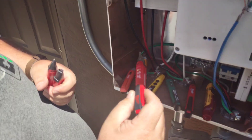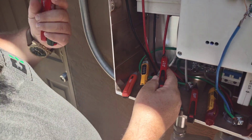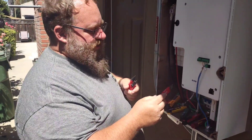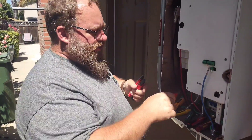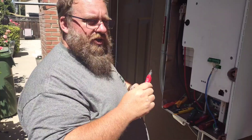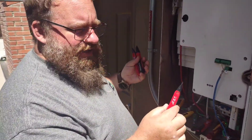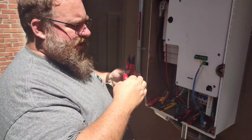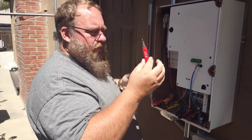The only problem I have with their newest version — these are a little more expensive — is the sound is kind of dull and a little slower, and it's going to take me a minute to get used to. Now why would that be important? Let's say we have a loose connection. That loose connection means it's not getting really good voltage, and sometimes you'll test a wire with your meter that you might think is fine, but it's dead with your voltage sniffer. You need to always retest with your meter before you do any work. Wet wires are a real big problem too — if you have wet Romex, the paper inside it getting wet will defeat these. You always have to double-check with a meter.